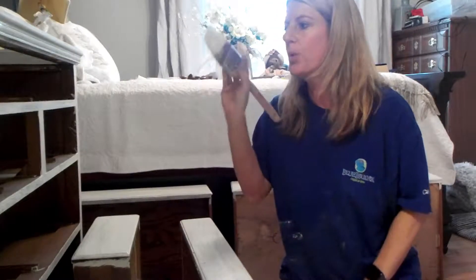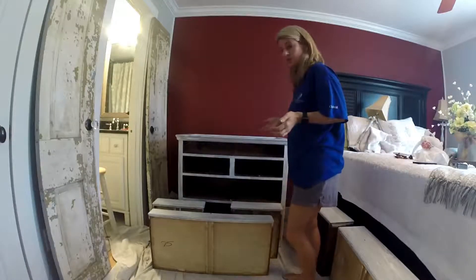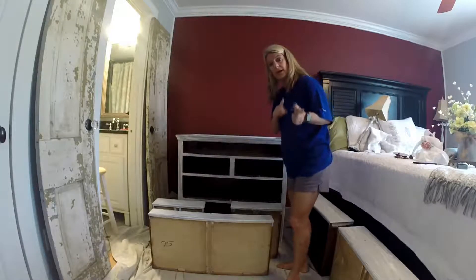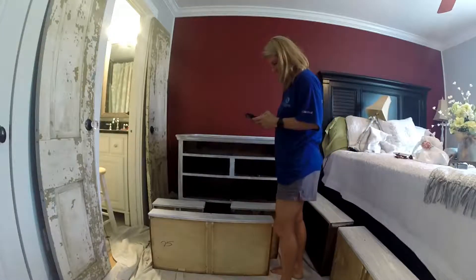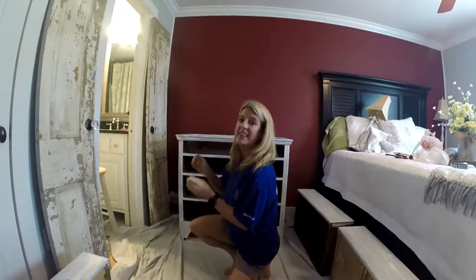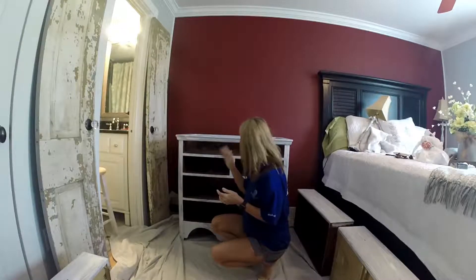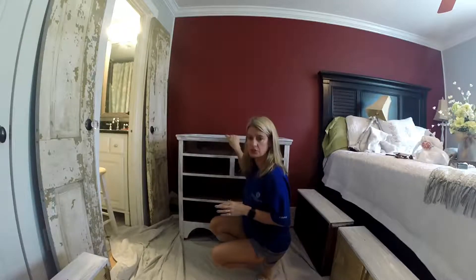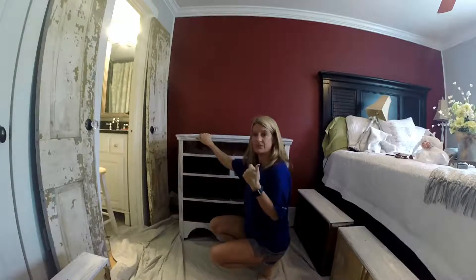All the drawers are done. Now we are going to wait for everything to dry — after I set up a showing for today. Now that it's dry, you can rub your hand over it — it's really dry. I'm going to put another coat on it. This time you're really wanting to focus on coverage. I should only have to put one more coat on everything and then it'll be ready. Just making sure you keep the strokes going the same way, not flopping around.